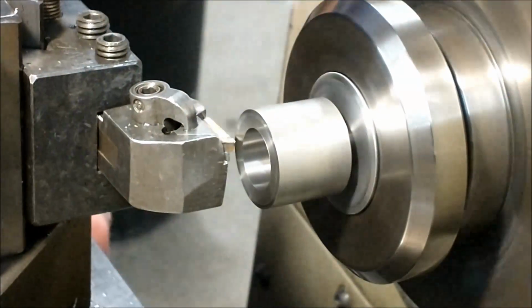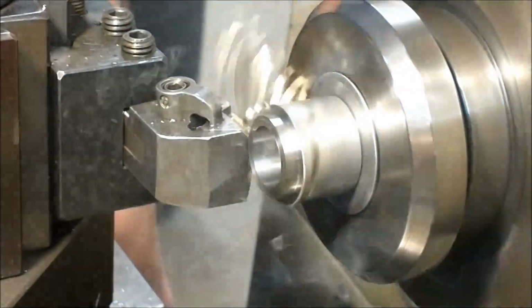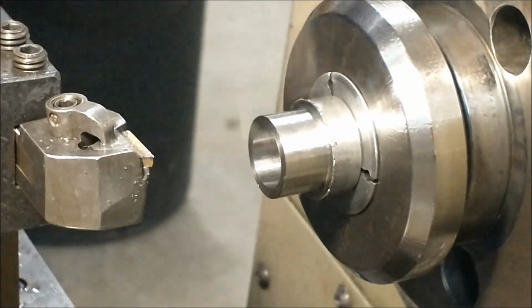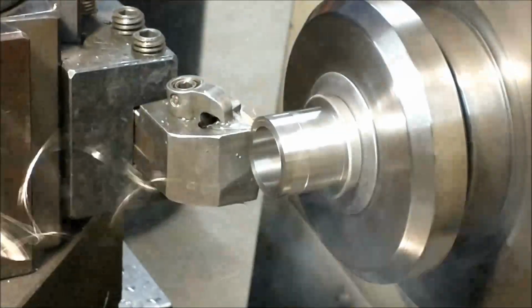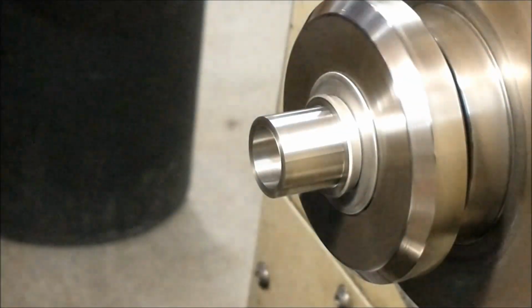When the time comes that you use this little attachment, you're going to want all the room that you can spare. So along with a thinner wall expanding and accepting a press fit easier than a thicker wall, make sure that when you neck this down, leave a little shoulder on there to bump against the face of the drill chuck you're going to stick it in, and leave enough material to keep it rigid and functional.